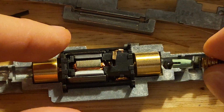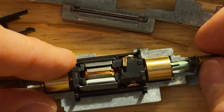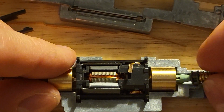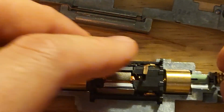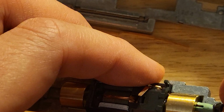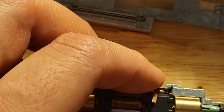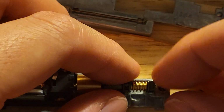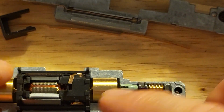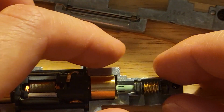Let me now put this shaft back in place. I think that might have actually been the problem. This was jammed solid. As a result, it wouldn't spin over. So let's now get this thing back in place. If I can remember how to do this, it's been a while. The hex head lines up that way. And this goes forward. And these two blocks need to be squared. I'll try to keep you in the shot so I can show you. So the hex head lines up into this assembly here. And you know you have it in because if you do that, it'll turn.